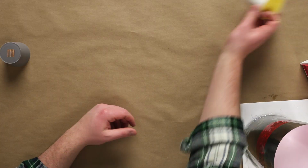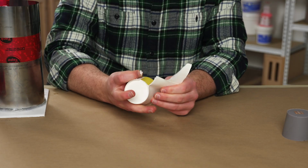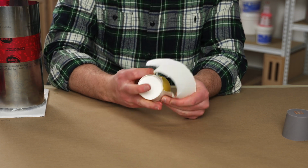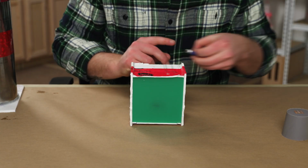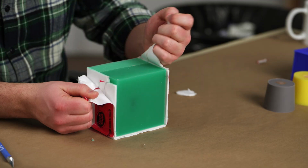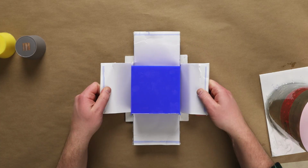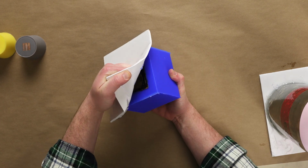If we used a convenience mold or even a light-duty mold, we can most likely just tear away at our mold box since we don't plan to reuse this material. Keep in mind how the material of our mold box will affect our demolding, though. If we used a plastic container, we may need to carefully use an X-Acto knife or another tool to cut it away. If we find ourselves running into sharp corners, then properly protecting our hands is a good idea. A foam core construction is usually easy to remove without the need for additional tools or safety equipment.